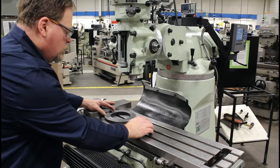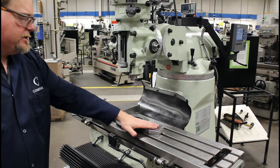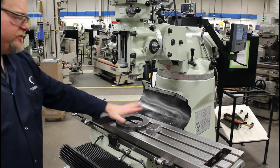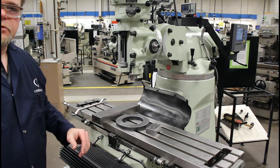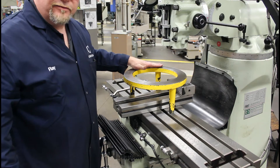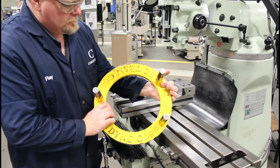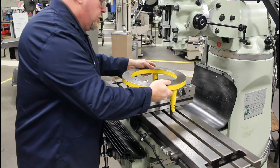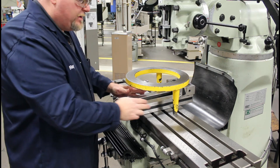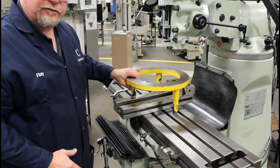The raised ring. What are the drawbacks of all three of those options? The biggest drawback is you have to have the vise off — taking the vise off and putting it back on. That's where our last option comes into play. The tool that people like is one of these elevated rings; this one is made by Easy Tram. What it does is it elevates it so you can keep your vise on instead of having to pull the vise on and off. It just makes it easier, and you can make one of these relatively easily as well.